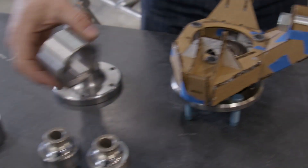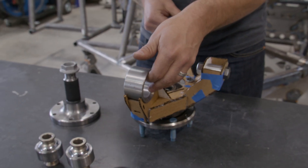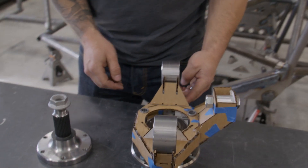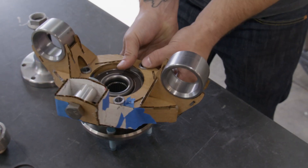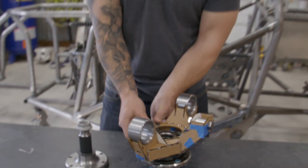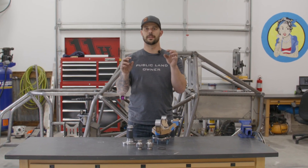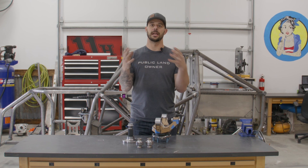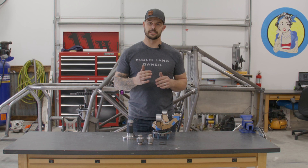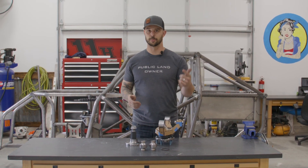The last thing to check is the cups — these weld-in cups are just going to fit nicely into these grooves, just like that. Now we have a nice upright design, and I'm really happy with that fit. I'm going to double-check all of those tabs and make sure there's enough tolerance around them. Since we're going to be hand bending these parts, I'll add that little extra tolerance we talked about earlier. Then we'll send these DXFs out to SendCutSend, get them back, and start the build process.